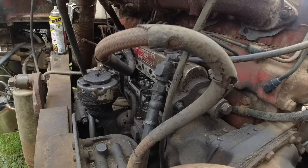So we just put it on that mark, huh? No, you need to advance it, maybe 20. Oh, no, it says 22 degrees. Yeah, but isn't that mark about 22 degrees from top, it looks like? On the harmonic balancer, that little thing we were discussing. It isn't straight up and down. Yeah, it's got to line up with that. Oh, I see what you're saying. Can you take a picture of that and send it to him, asking if we line it up with that, does that look right?